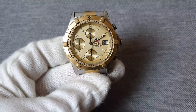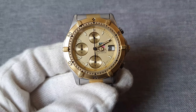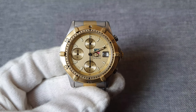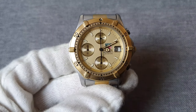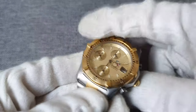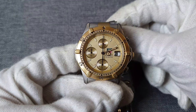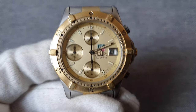Let's have a look at the movement. It is an ETA 2892 movement with a Dubois-Depraz chronograph module put onto it. Of course, the ETA 2892 would not itself be a chronograph ordinarily. While this might sound like a reasonably basic movement, it is a workhorse movement from the period. It has a movement speed of about 28,800 beats per hour. With the Dubois-Depraz chronograph module, it has a chronograph function. The movement itself is also relatively thin - under four millimeters thick - which makes it easy to fit into a wide variety of cases. It is also approximately 25 to 26 millimeters in diameter, making it ideal for many of these watches, and reasonably versatile in terms of how it fits into many watches.